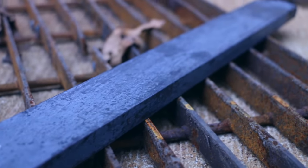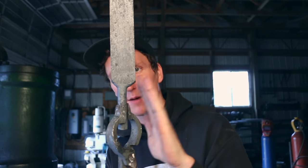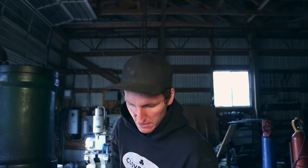The only thing I'm slightly nervous about is this peg didn't move. It's lopsided. And the important thing with this particular Damascus pattern is that it's so critical that the material moves the same because there's a center line to it. And so if it's off center, it looks stupid. So hopefully we got it. I got a ton of material here for our project, so I hope that if there's anything messy, I can cut out a good section. So anyways, I'm gonna let this cool off and we'll get to the next step.